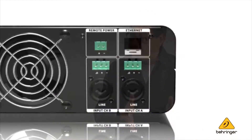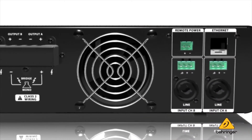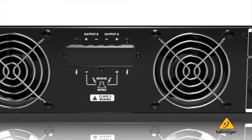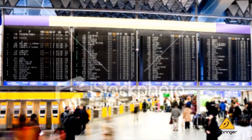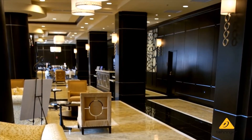The AX series lends itself to a whole range of applications. For example, the AX6220Z and 6240Z are perfect for high impedance distributed speakers where you may have from 10 to 100 loudspeakers on one speaker circuit. So they're ideal for places like airports, convention centers, hotels — a lot of large scale applications.